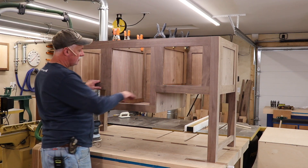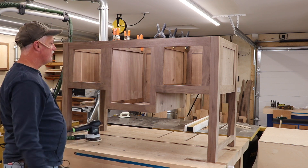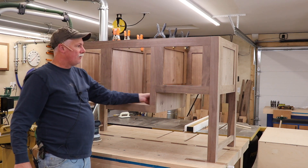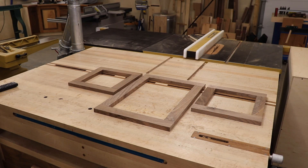This morning I decided to add faux strips to the inside so the interior will look very much like the exterior. I've got them clamped on — just glue at most spots, and a couple of pin nails where I couldn't get clamps. I'll let that cure up and then get after the doors. Here's the stock I've milled up for the doors — just dominoes again, but I'm going to try to center the domino because on the upper and lower of each one I need to do a stopped groove for the quarter-inch panel, so I want to land those in the domino to make life a little easier at the router table.